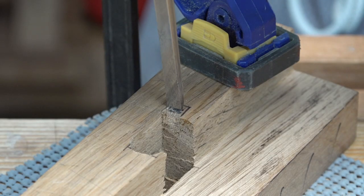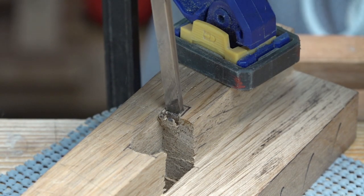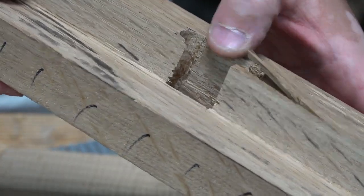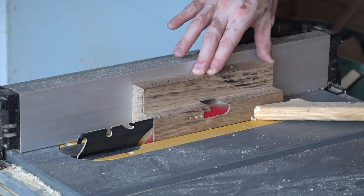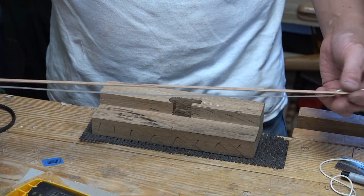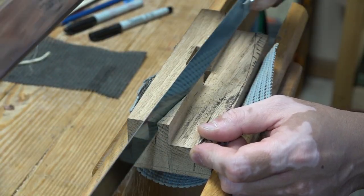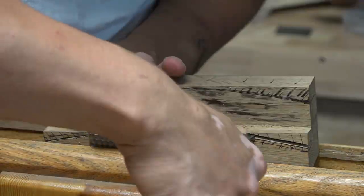The slot for the wedge is tapered — one quarter of an inch deep on the blade side and three eighths of an inch deep on the opposite side. Be careful not to crack the wood, but if you do it's not a big deal, just glue it back together. During final sizing I ended up trimming off that cracked layer anyway. I tied a piece of scrap wood to a string to create the arc profile for the cutting gauge. If you're interested in making a Chinese frame saw like the one I'm using, follow the link in the description.